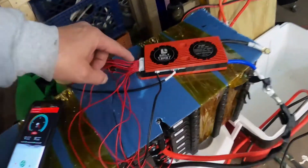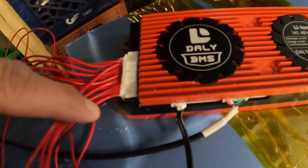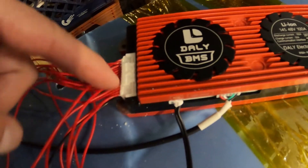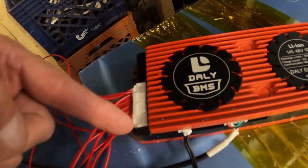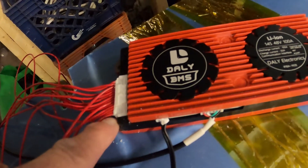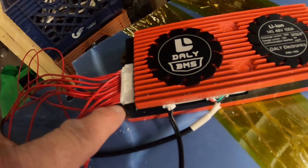So let me go over this again. The reason why my Daly BMS was not going on and wasn't finding the Bluetooth is because these right here I had opposite. If you turn this over and count your voltage, mine went from 3.7 out to 53 in. When you get this black wire, it's supposed to be your lowest, furthest battery. Wherever the black is, the positives to that battery go up this way.